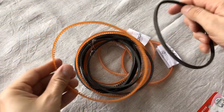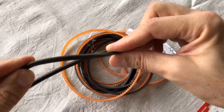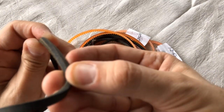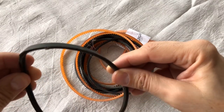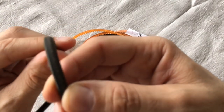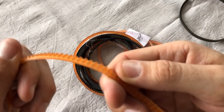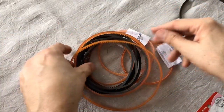Going over new parts wouldn't be complete without mentioning belts. You can get belts made of traditional rubber — they look and feel like old car fan belts but for sewing machine motors. The traditional ones have a V-shape on the underside that touches the pulley. Whenever I restore a Singer featherweight I often use these for historical reasons. You can get brand new black rubber V-belts, also called V-groove belts, to fit the pulley groove. For other machines I use what are called lugged belts — L-U-G-G-E-D — which have little ridges and some believe give better traction.